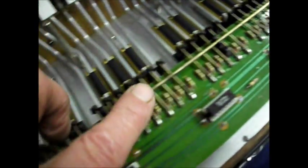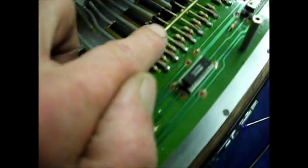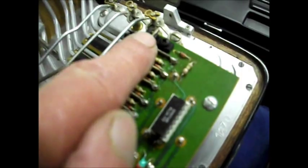So if you get notes which are not playing properly, if you've got multiple notes, it could be the connection underneath there which needs cleaning up. And what you have to do to clean that up is to remove this bar. On this one, it looks like a snap-in part. It snaps into there. And this end as well, which has got a soldered component on here, which is giving us this power supply, if you like. And those are the red leads on there. Anyway, it's just the one joint there.